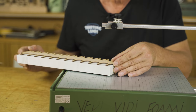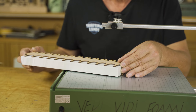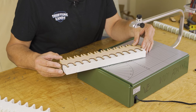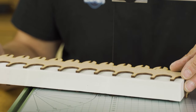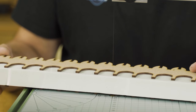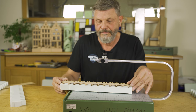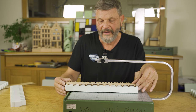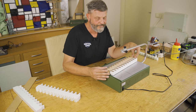I follow the shape with the wire obviously, and that's something you really have to get familiar with: know where the wire is, know where it is underneath you, feel it. Try to apply as little force as possible towards the wire, and keep it as straight as possible. It will not be perfectly straight because it needs to touch the template on the upper and lower side, but try not to push too hard - very gentle. It takes a little bit of time to get used to it, but once you know how it works, it's great.